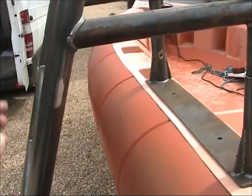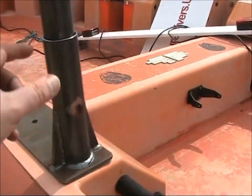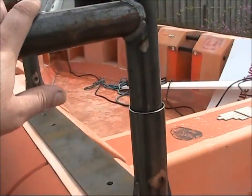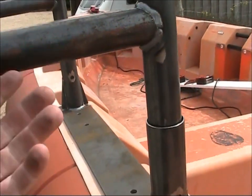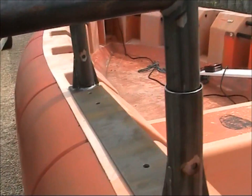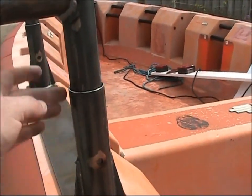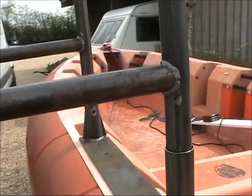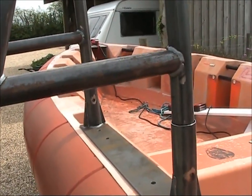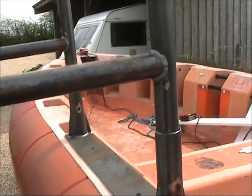Right, so this is just a retrofit. Now I know that it's okay. I've got a little bit of work to do on the fitting, because when it's been welded, as you probably know, when you weld stuff, it contracts and distorts and moves. And that's what's happened here. It doesn't fit in these as smooth as I'd like, so we're gonna get it back in the workshop and get it sort of twisted and bent a little bit, get some heat on it, so that it fits a bit better.